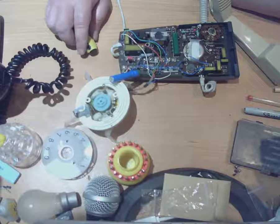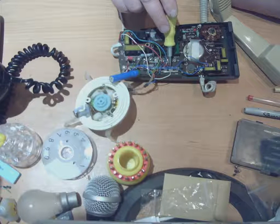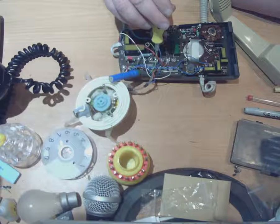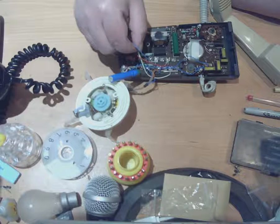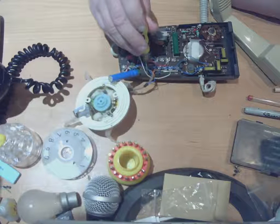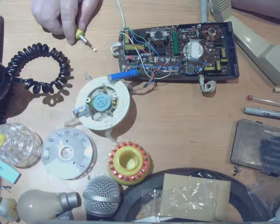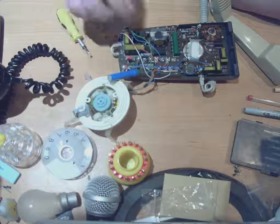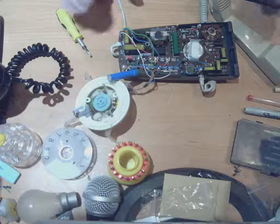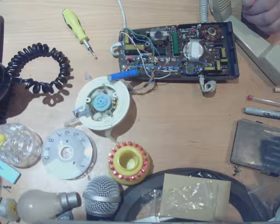For your line cord: your red goes to T8, your white goes to T18, your blue goes to T6, and your green — which basically doesn't do anything at all — goes to one of the unused terminals on the bottom. I normally put it on T15, and in this particular case it's on T14. But they're unused terminals anyway, so you can put it on either of those, because that green one in the line cord becomes pointless. You don't even have to connect that one up if you don't want to — you can leave it disconnected.